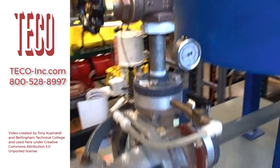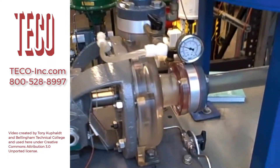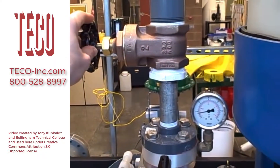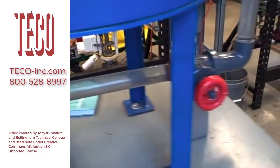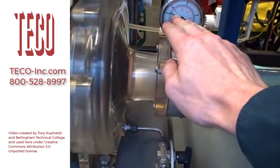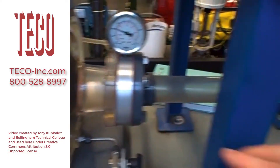What I'm going to demonstrate here is cavitation. We're going to purposely cause cavitation to occur in the system. We're going to do so by keeping the discharge valve wide open and pinching off the suction valve. That will reduce the pressure in this line, and you'll see this compound gauge show a stronger and stronger vacuum as we begin to pinch off this valve.